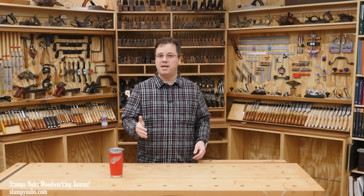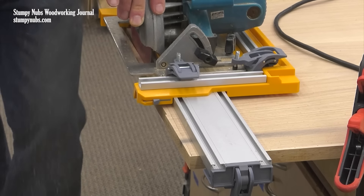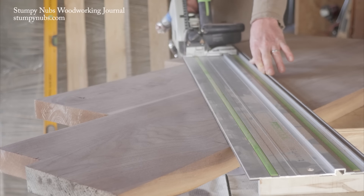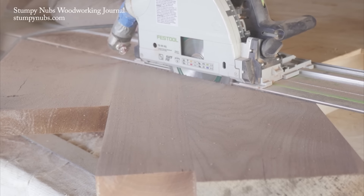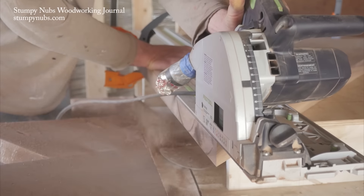This can be an intimidating process because slabs are very likely large and unwieldy, and the last thing you want are gaps in your joint. We cut one of these with a track saw and the other with a circular saw and an edge guide. The track saw was easier, especially for the angled cuts, but both did the job and you can get by with whatever you have. It's important though to make the entire cut in a single fluid motion if you can — try not to pause mid-cut or you're likely to leave a blade mark that might then appear as a gap in the finished joint.